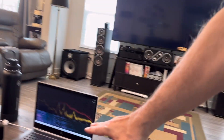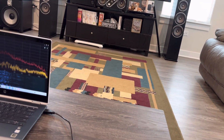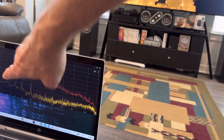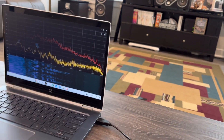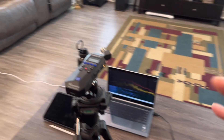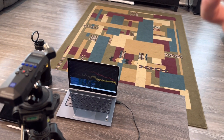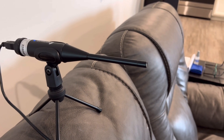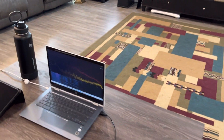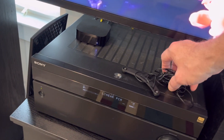Down here you'll see the computer — this is hooked up to Spectroid, an app that measures frequency response. It creates a hold line, and the yellow line is the live music. There's also a waterfall graph so you can see decay. I've also got a 32-bit stereo mic I'm going to try, to see if there's a big difference between that and the camera mic. And I'm using the Dayton OmniMic — a calibrated microphone — feeding into Spectroid.